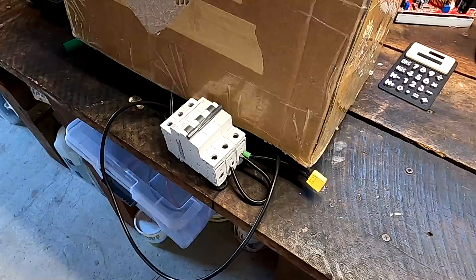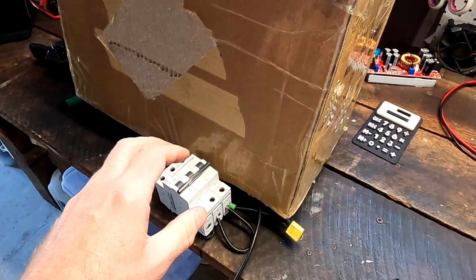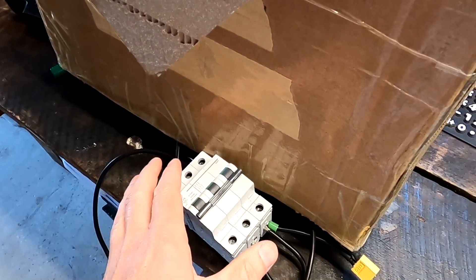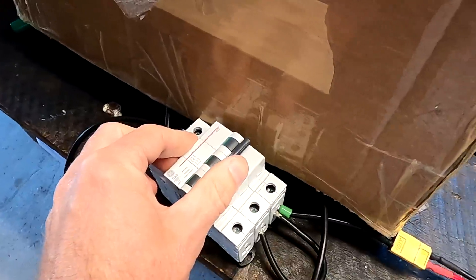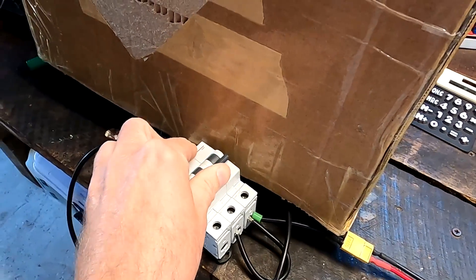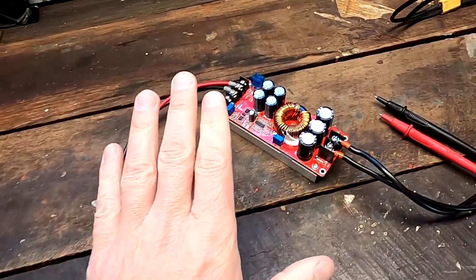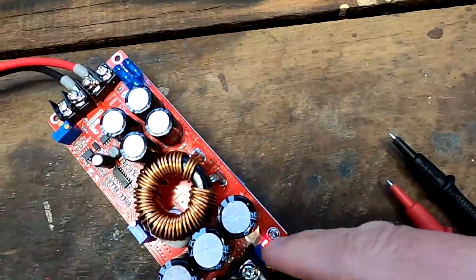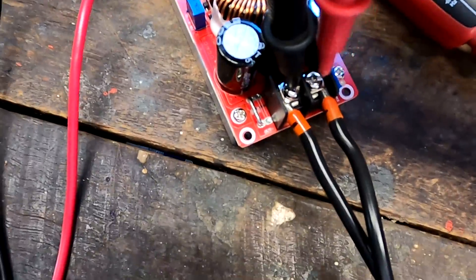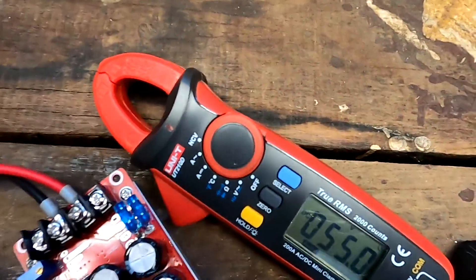What we have here is a mystery battery — let's refer to it as a battery for now — which will give us effectively unlimited amps. I connect it up and turn on the circuit breaker, having turned off the big battery. Let's turn this on — nothing explodes, no smoke. We've got the red light for output voltage. The input is 13.6 volts and the output should be the same 55 volts we set before.